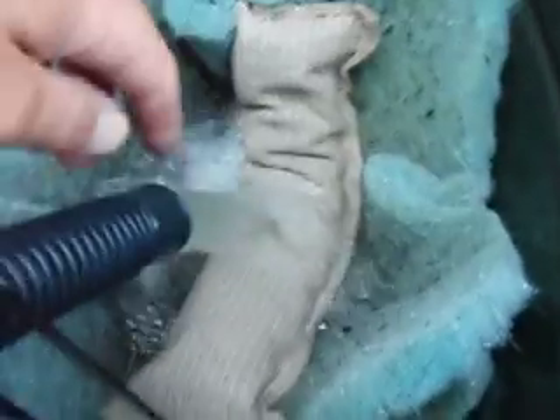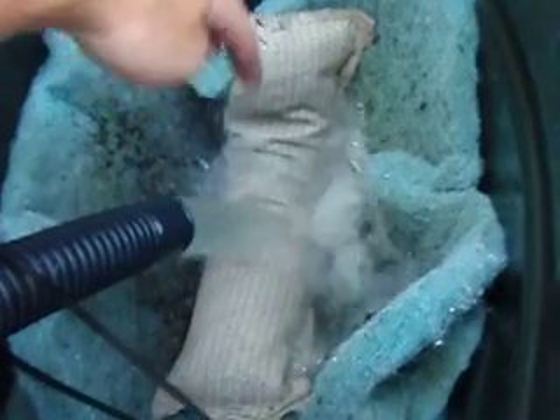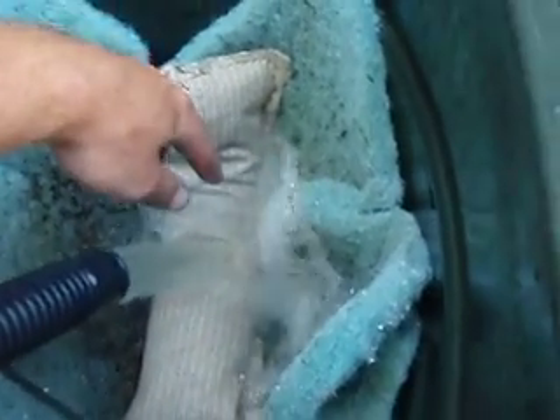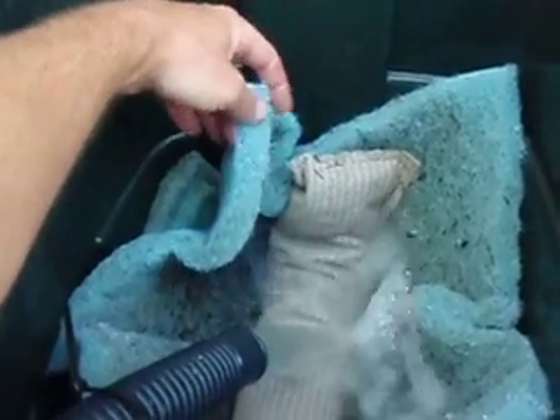I've got a zip tie holding the hose exactly where I want it, because you want the water to hit this first — this is a bag full of carbon. The bag is made from sunshade material, the same stuff that's over there keeping the sun off. It has really good UV resistance and longevity. I stapled it up and filled it full of carbon, because you want the water to hit the carbon first. Then I've got about 15 to 16 layers of swamp cooler pad below that.